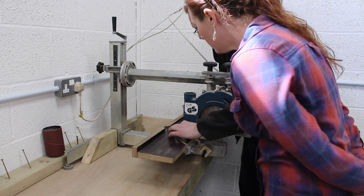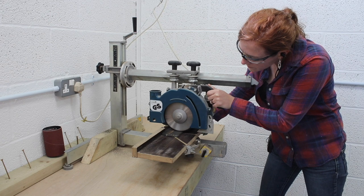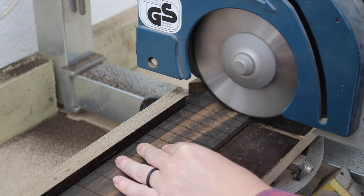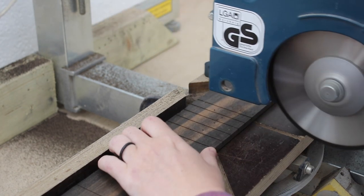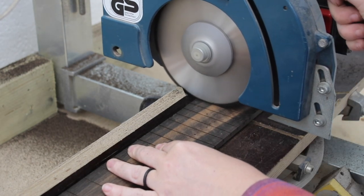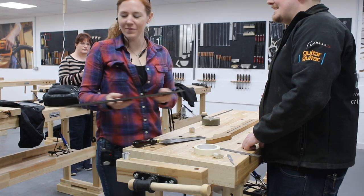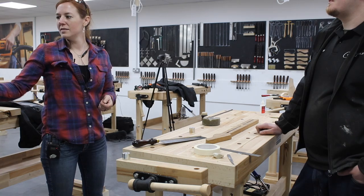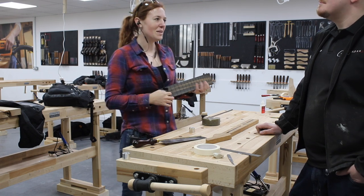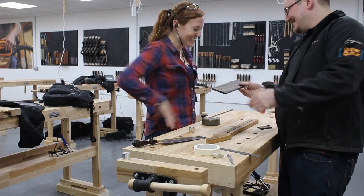Crimson's template has the spacing for the frets already lined out with notches, and they have a pin placed on the deck of the saw for this notch, so you can just move your fretboard along notch by notch until all the frets are cut in. Ebony is crazy dense — the wear resistance is remarkable.